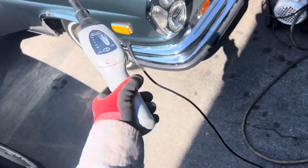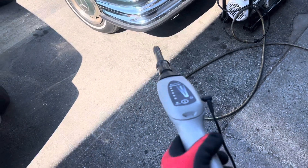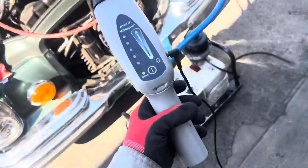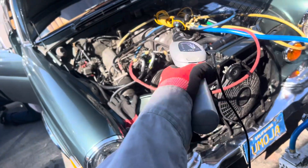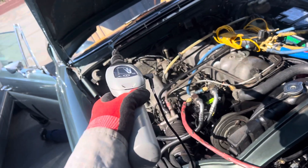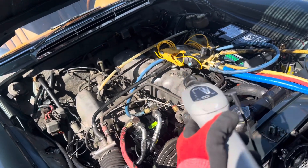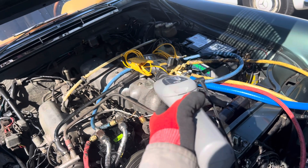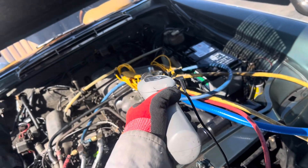From a couple feet away, that leak right there — when he has that panel off, from about three or four feet away I can hear it through the earpiece. This device has an earphone; it's in my ears. I can hear that leak even though we're at 29.9 inches of mercury right now, because we're not going into microns. If you had an analog gauge, you would never know — because microns tells you there's a small leak at vacuum, while 29.9 on analog gauges...